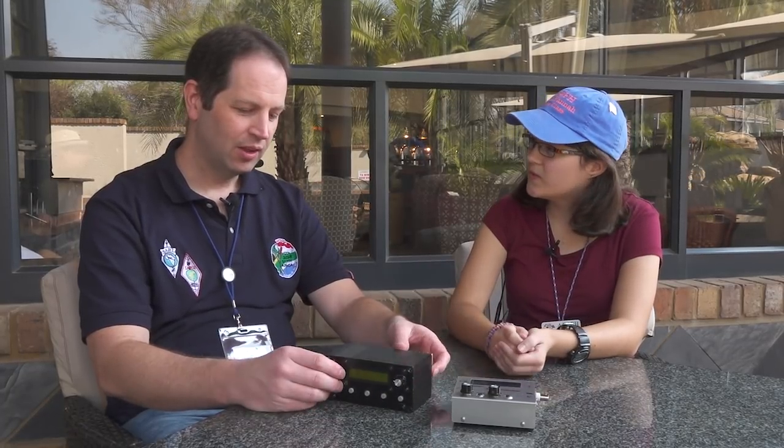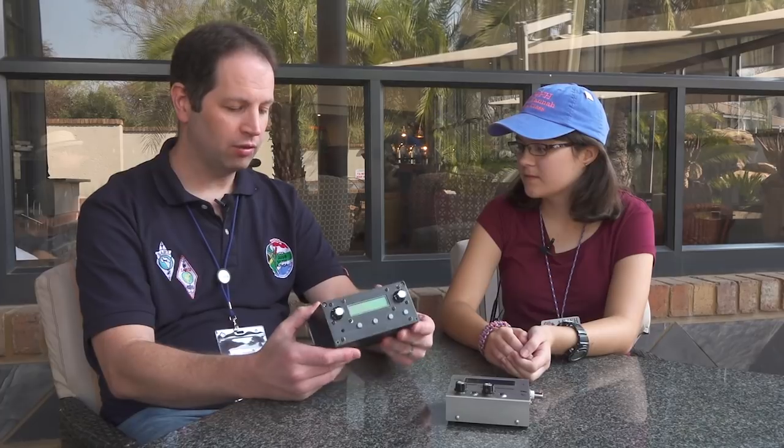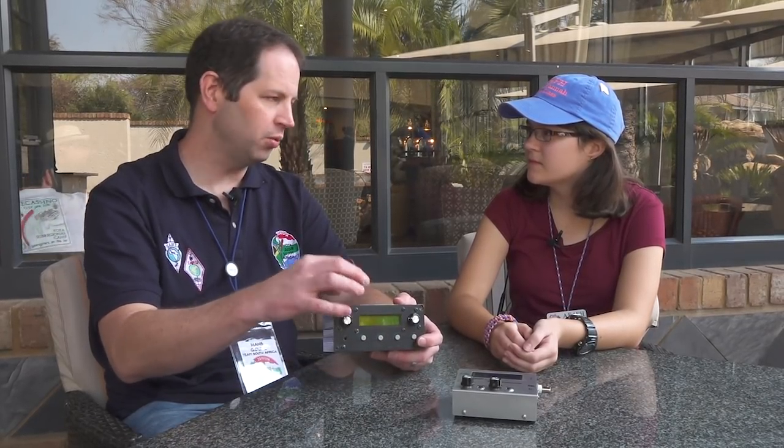So what does it do? It's a very long list of features. This is a 40-meter single sideband transceiver kit with a 10-watt linear output, but it's all software-defined radio with no PC required. Internally it's a software-defined radio, meaning all the signal processing is done on board with a powerful 32-bit ARM processor. It doesn't require a PC.